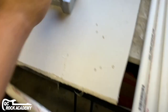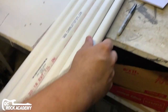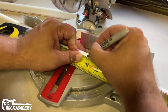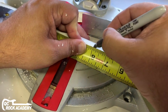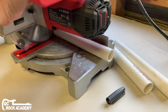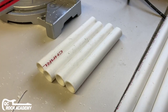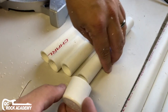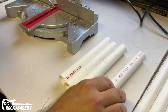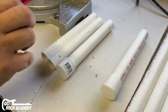Cut that. Good catch by my wife. So you have your two 28 and a quarter inch sections, and then lastly mark out eight inches for the footings — you'll need four of those. Once you get the four eight-inch pieces, take your caps and put one cap on each eight-inch piece, and those are all your cuts of the pipes.